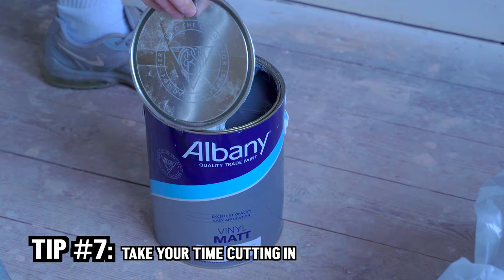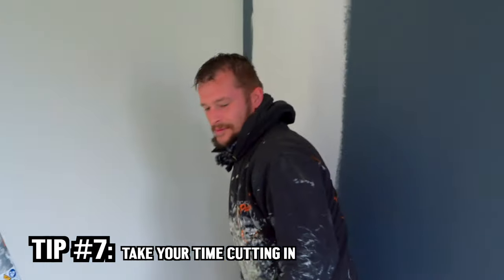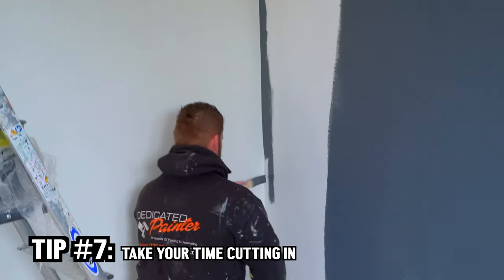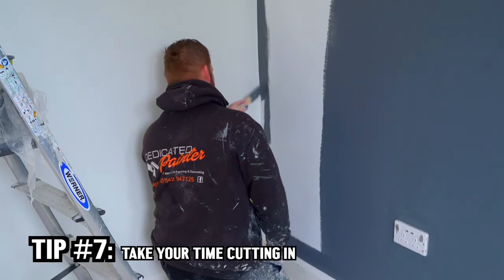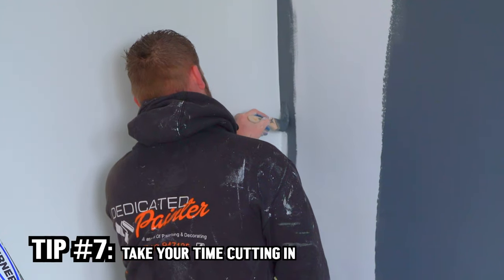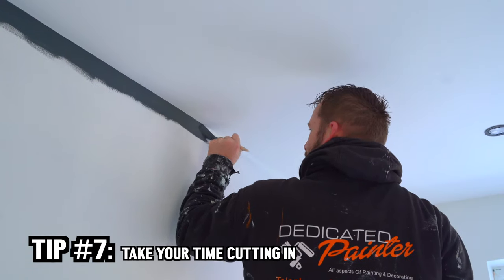I'll get my brush, load the paint onto the wall away from the edge first — my favourite is Pro Deck, which is what Brewers gave me to use. Go back onto it where you've just loaded, and then just slice down your edge for cutting in. All it basically does is take the excess off. Too much on your brush and it's going to end up throwing paint all onto your current colour.